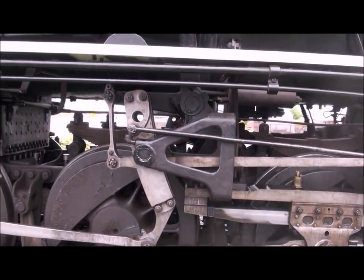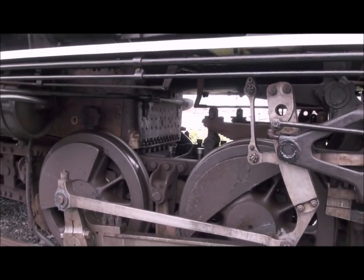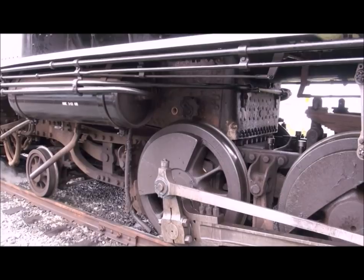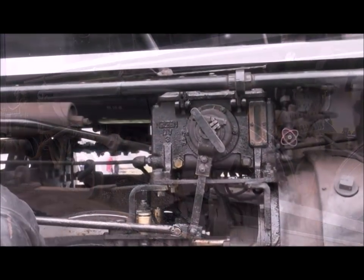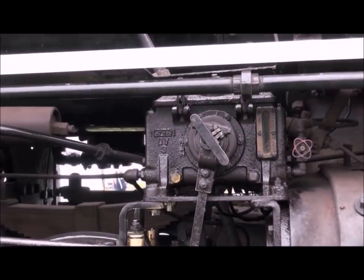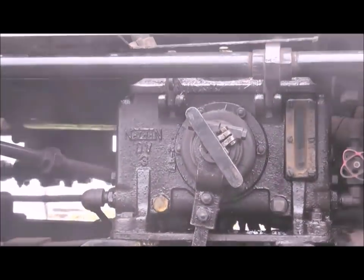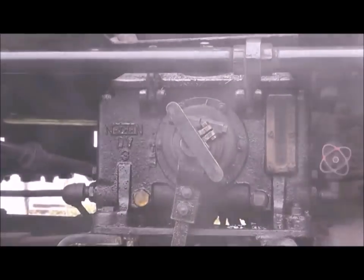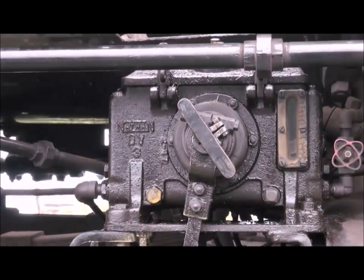That power reverser we talked about lifts or lowers this rocker arm, which is connected into the valve, which allows the steam to go to one end of the piston or the other. This is the magic involved with a steam engine — this is what makes it actually work. Keep in mind that these steam engines at the time were the rocket science, the epitome of engineering. And all of this was developed by pencil, paper, and slide rule. Now this is a mechanical lubricator, which forces oil around different places — in particular, it forces oil into the piston. So this would have steam oil in it.